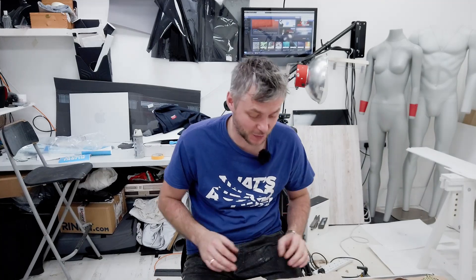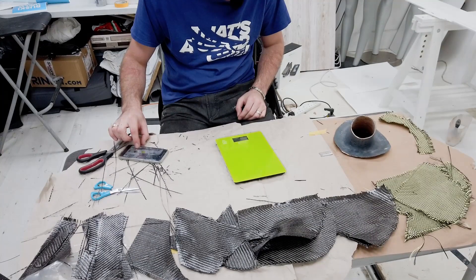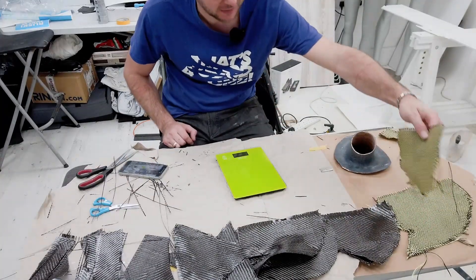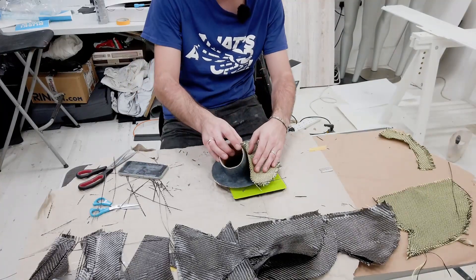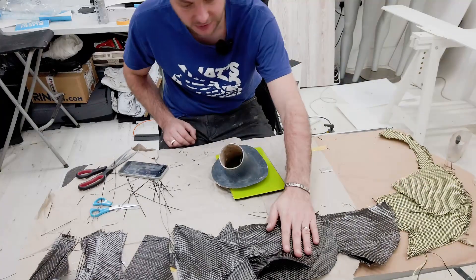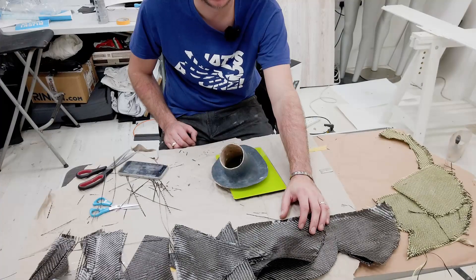Here we are after the first coat of primer and sanding — this is extremely smooth, I'm really liking this. It definitely needs another coat and hopefully this will be the last coat. It goes on thick and I'll be able to sand it. As long as we're not going to break away through the coat into the filler we're good to go. Now we're ready for production of some composite materials — I'm super excited. I've pre-cut all of the materials. We're using carbon kevlar as the outer shape layer, and normal two-by-two 200 gram twill for reinforcement.